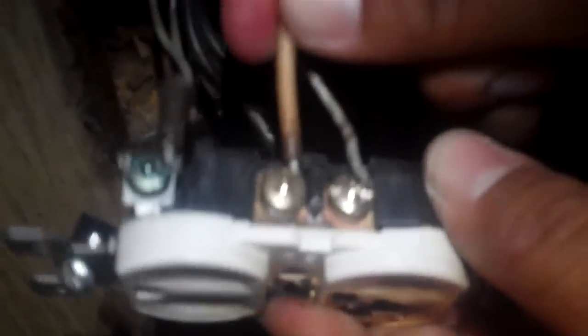This is what happens when you don't hire an electrician who knows what he's doing. It's completely bare — you can see the melting of the insulation right here on the power wire and on the neutral. Really bad. That connection is loose, and that's from aluminum wiring. Go ahead and show how that connection got loose — when he wiggles the wire, you'll see the screw turning.